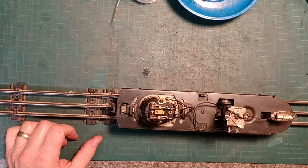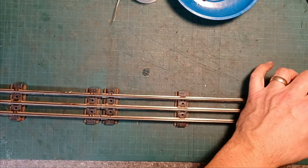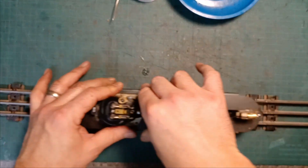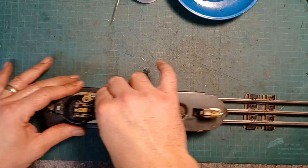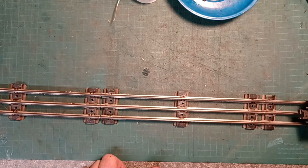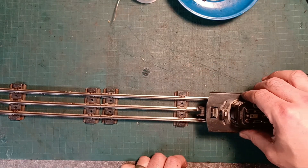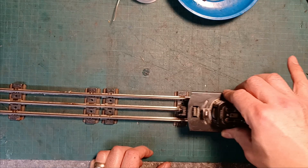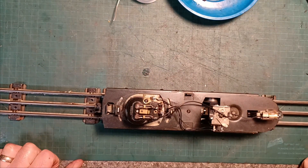We have applied more lubricant down into the motor, more lubricant from the grease, and we've been working it back and forth — pushing it along the track to really get it working in there. It is moving much freer. I am confident we are heading in the right direction, so I'm going to put some power to this. Still the reverse is the problem. As I apply power in the reverse direction and push down on the motor itself, that little bit of help helps it move much freer, so there is still some binding going on down in there.